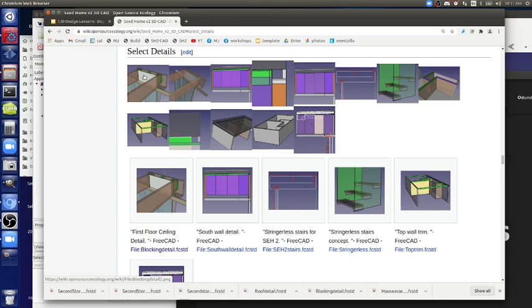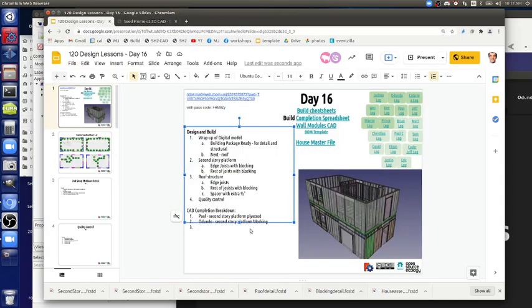But that was 4 inches because that means the face blocking will end up even with the interior wall. The interior wall has to match up where you do the blocking. So the blocking ends up 4 inches. Okay. You remember that detail? Mm-hmm. Take a look at that file and study that. So, second story platform blocking. Next, that's important for structure.